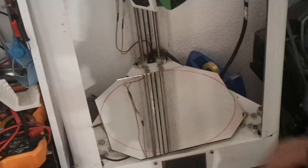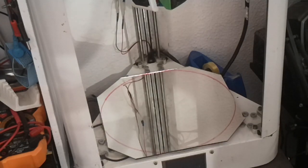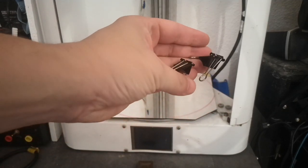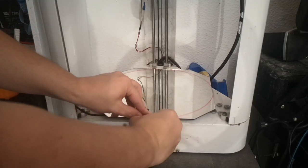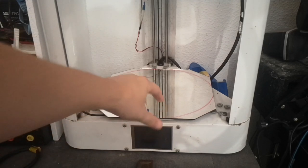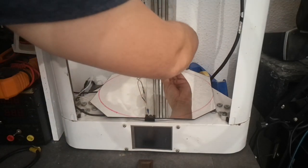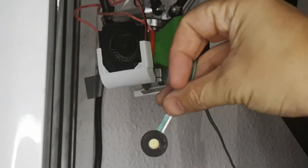I just put it over the metallic base - I'll use that as a backing plate. I was a little scared that probing with the 3D printer would split the glass because it's bent underneath with some space to move. I'm using binder clips - the smaller kind because you can take off the small arms after you clip it on so it's not permanent. If your 3D printer has auto bed leveling, be careful with the head so it doesn't hit the clips. In software it's called probing radius - just reduce it a little from maximum. I had it set at 240 millimeters so two centimeters in is good enough.